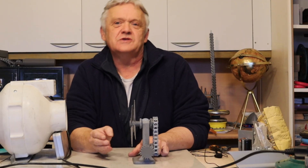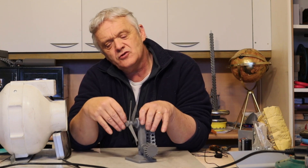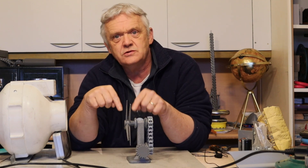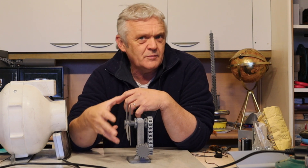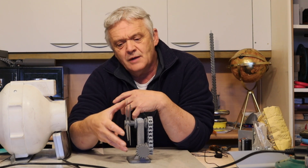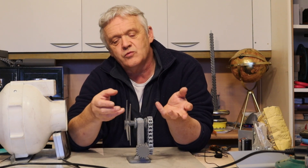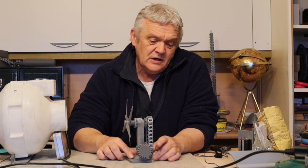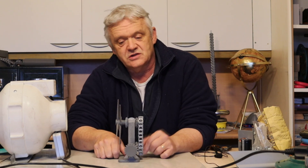This is obviously a model and with it we can do some testing. I've just put the two blades close together here. We did some reading that said the distance between the two blades works best at a quarter of the diameter — I'm not sure I believe that, so we'd need to play with that distance to see where we get the best effect. We can prove whether one or two blades, or the distance apart, gives the better result.